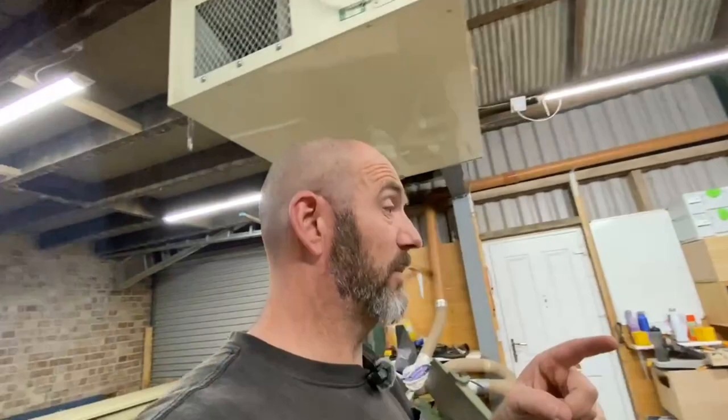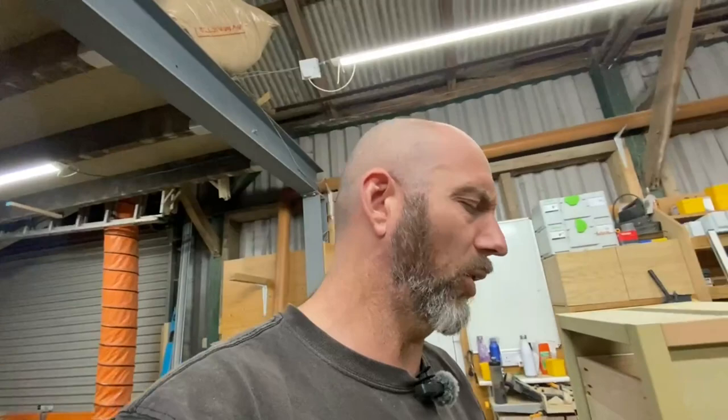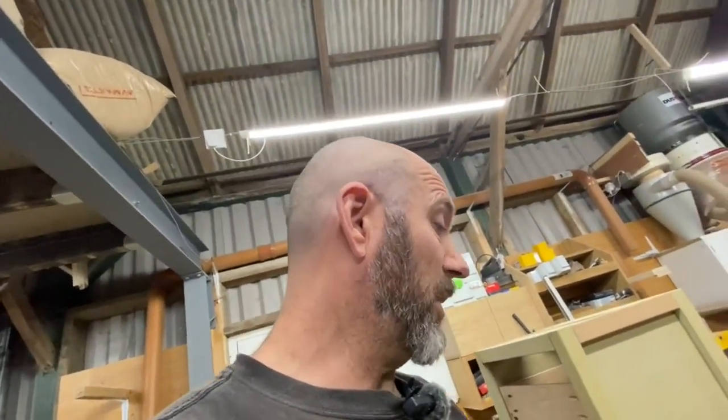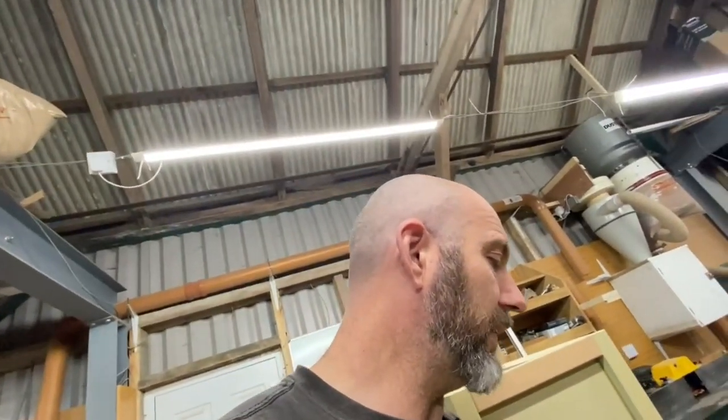Believe it or not. But yeah, because there's a guy actually on Instagram that all his stuff, all his long wardrobe doors like these, and he churns through the work, and his work's very good as well. His work's got some really next level stuff, but all of the backs of his doors are flat, I've noticed. So I know that he glues and clamps them all. I'll just be interested to know how he does it. Maybe they use contact adhesive. I just would have thought it would have been PVA. Well, you can get 10-minute PVAs and stuff. I think the stuff I'm using is 20, 25 minutes.